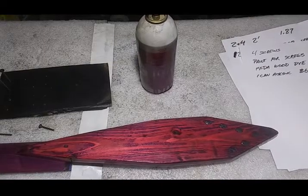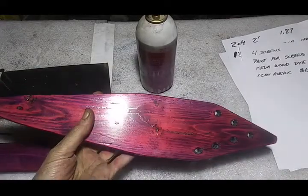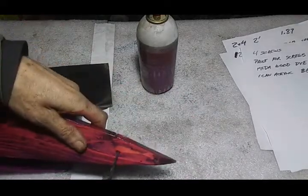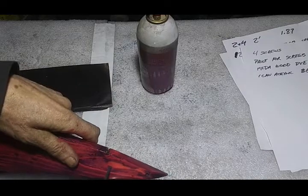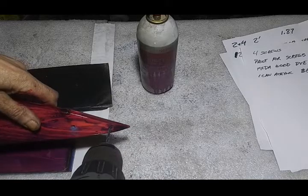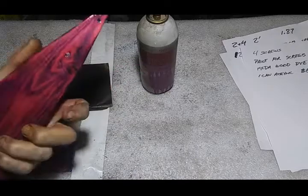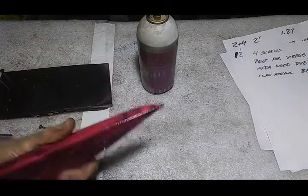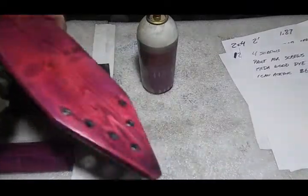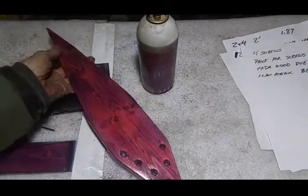One thing I need to do, since the body came out of the paint shop and it has a bunch of pre-drilled holes in it, is that all these holes need to be chased. Do the next screws from this side. That way, if you get a tear out, it's on that side and it's under the neck where it doesn't show. And I'll use a reamer for these. The low budget way would be to just re-drill like I just did for the neck.